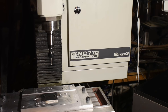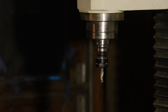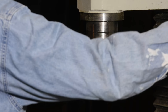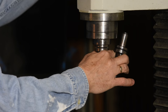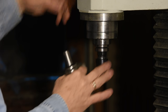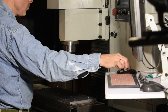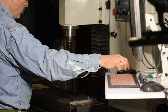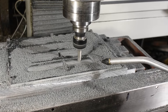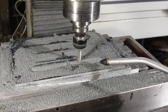The system consists of three main components. First is the mill itself. It has a rotating spindle that can run any number of cutting tools including fly cutters, drills, and various sorts of end mills — that's a drill-like tool which, unlike a drill bit, can cut sideways or up and down. The spindle can move up and down; in milling parlance this is known as the z-axis. It also has a table that moves side to side — that's the x-axis — and front to back, which is known as the y-axis.